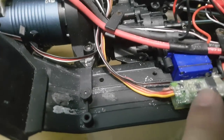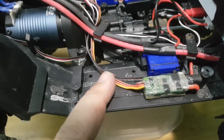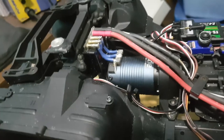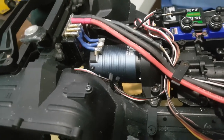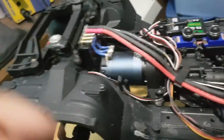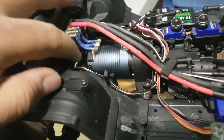The nice thing about Goop is you can actually peel it back off the circuit board - which I did when I shortened this servo lead, and then just re-gooped it, so now it's all sealed again. For ESCs like this one it's a little more technical. I use a syringe and something called Corrosion X, brush that in, then syringe a thinned mixture into the circuit board inside the coating, then coat it all and put the case back on while making sure all the buttons still function.